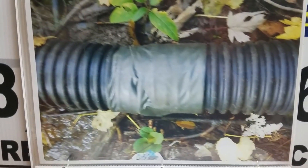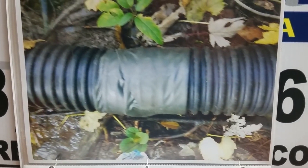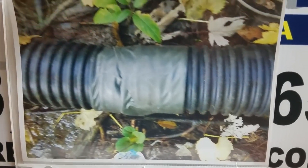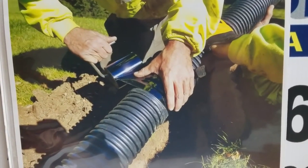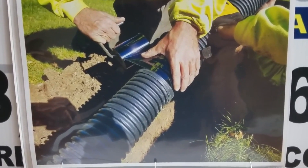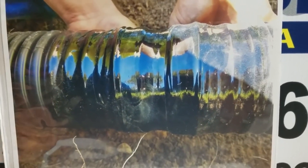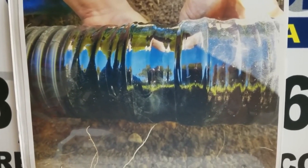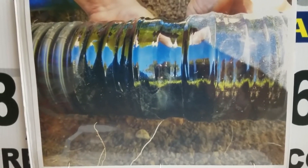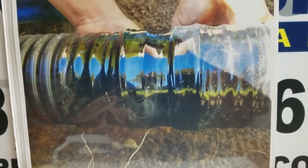What is with the duct tape? I'm digging up these systems and having to replace them, so I'm going to help you out. You want to use a PVC tape known as tile tape. It's PVC, super stretchy, super sticky — you can see it's watertight and just forms right to the shape of the pipe. The manufacturer says this material will last 200 to 500 years. Don't use duct tape, don't use silicone — use tile tape.